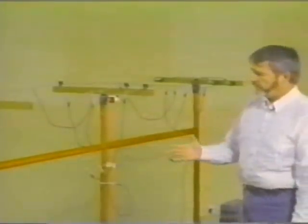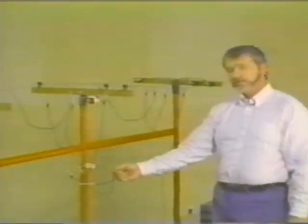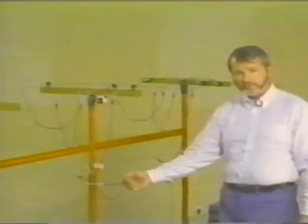What you see before you now is basic dual point grounding. Grounding on both sides of the work area at the work site using the grounding cluster and a lead up to the neutral to create a zone of equalized potential.